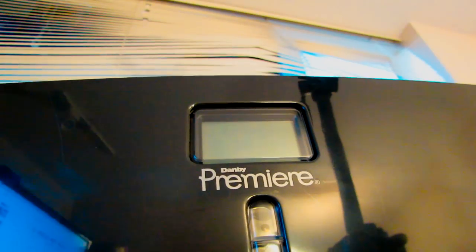and set your fan speed. Set it to max fan speed so that it operates at max efficiency. Now if you leave it, in 7 hours it will turn on and set your room to 19 degrees Celsius. But if you don't come home, make sure you don't set that because it won't turn off until you come back and turn it off. If the unit is on, and you push the time button, you can set it to operate for 4 hours and then it will turn off automatically.